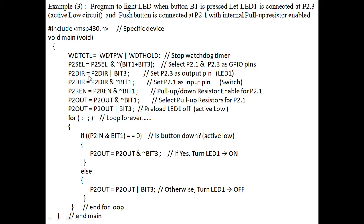After selecting IO pins, we need to select which one is input and which one is output. For that, we use the instruction P2DIR — that means port 2 direction. Bit 3 set to 1 indicates an output pin; 0 indicates an input pin. So P2DIR with a vertical bar and bit 3 indicates port 2, third pin as the output pin. Similarly, port 2 bit 1 indicates the input pin, which is the switch.